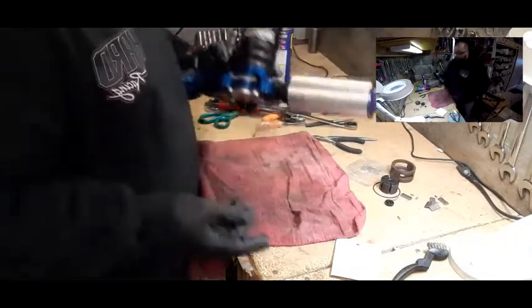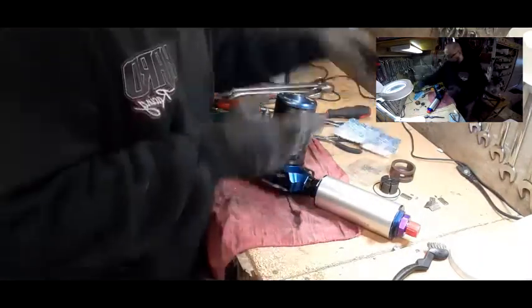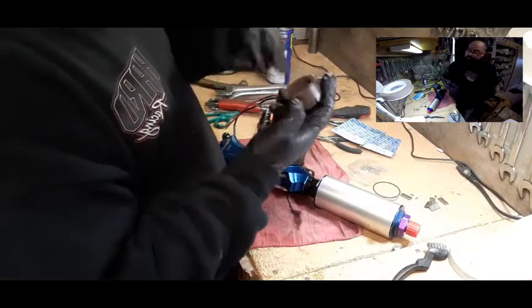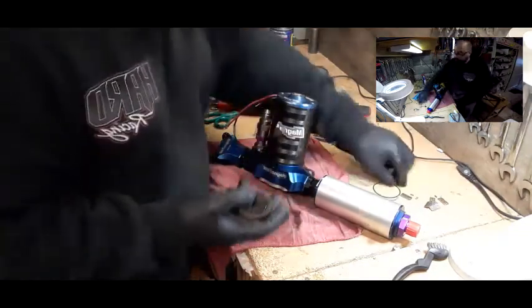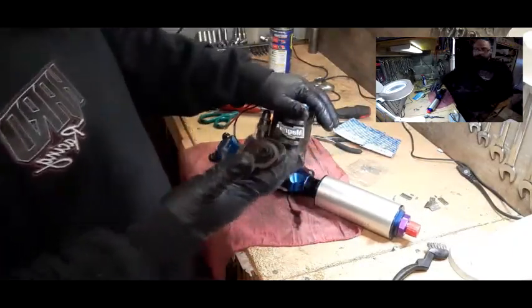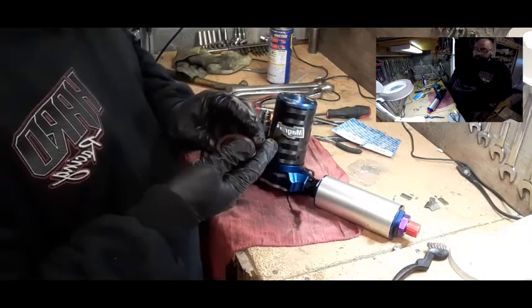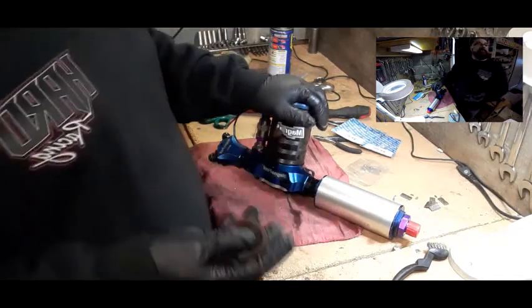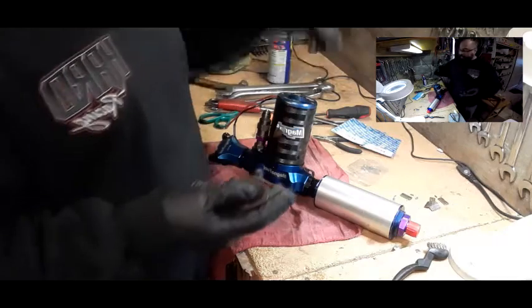And that's it guys! I hope this is helpful. I will put the part numbers down onto the video — maybe at the end or in the beginning — so you know what part numbers go for the rebuild of a Pro Star 500. This cup — for some reason the guy that did the video couldn't get the cup to walk right out, but I got lucky and this cup walked right out. There's the vane, the O-ring, and the seal. Believe it or not, this pump is almost 500 bucks. If you buy a used pump, as long as the motor is good, you're good to go — because you just buy this kit and you can rebuild it. I heard these pumps only last one or two seasons before you have to rebuild them again, which kind of sucks for something that costs almost 500 dollars.